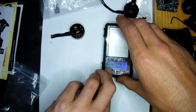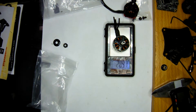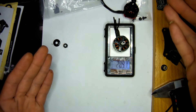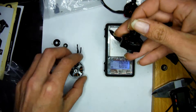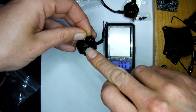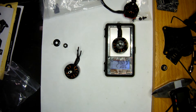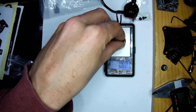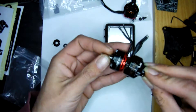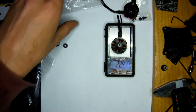We might as well weigh them. So that's a comparison — I've got 28.991, about 28.9 grams. And for the old H2206, 2250 KV — as close as possible to the 2400 KV — it looks like about 29.02. So they're a little bit heavier than the older series, but very, very close. It could even be the wire length almost.